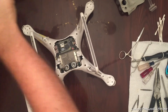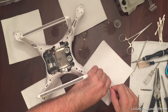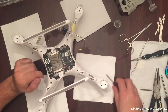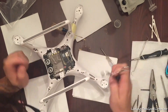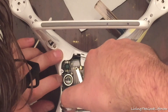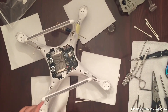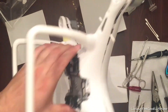It's a little messy but it gets all the water out and you can just vacuum the rice out. For safety I usually don't fly near water, but today I did — unfortunately it lost connection with the controller and I lost visual, so I couldn't tell what it was flying. I don't know if it was the high power tension lines or what, but she went down. When you take off the remote and remote antenna and the GPS antenna, be very careful because if you break these you're almost SOL — you have to get a whole new motherboard, which is one of the most expensive parts of the drone.